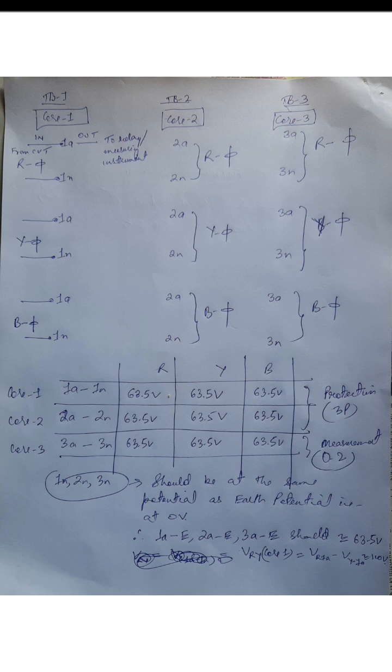Because every time, whatever the primary voltage is, whether it's 132 kV, 220 kV, or 400 kV, all will be stepped down to our measurable line voltage of 110. And if you want to take it single phase, because in this case I want to measure this particular phase, for example 1A with respect to earth, then I just divide this 110 by a factor of root 3, then I'm getting 63.5 volts, right?